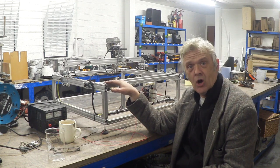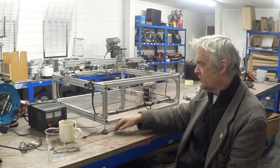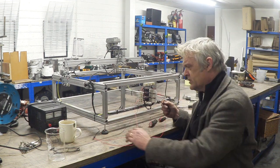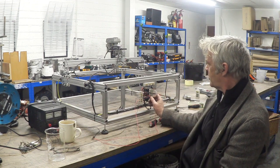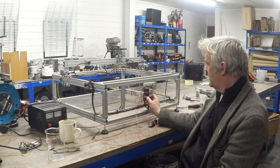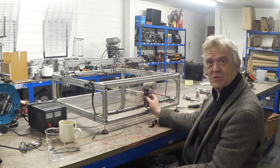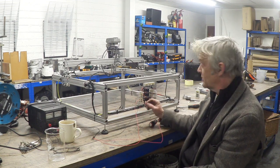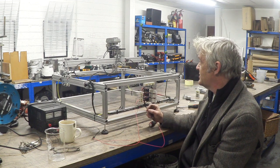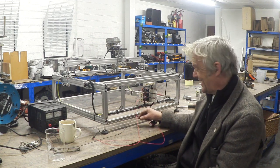It's on right now but everything's in the home position. I've got a trip switch here going to the live supply, and if I trip it onto the middle relay, you'll see that relay come on — there it is — and there is the top gantry moving. If I take that off, it reverses direction because the relay's gone on, hits the limit switch, and turns itself off. It's really kind of cool.